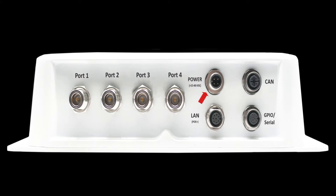The power connector is used in applications where Power over Ethernet is not being utilized. The input range for power ranges from 12 to 48 VDC at the reader. It is recommended to measure the actual voltage at the reader to make certain it is within specification.